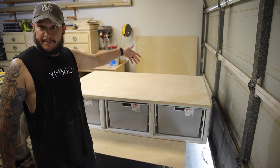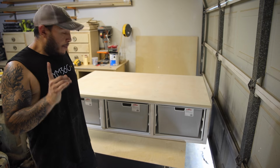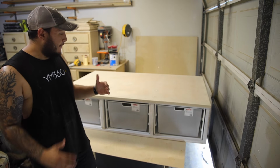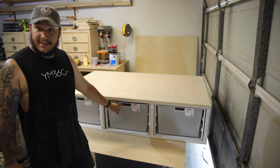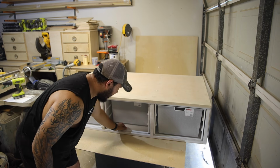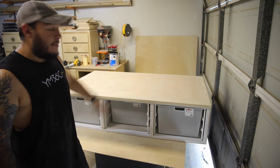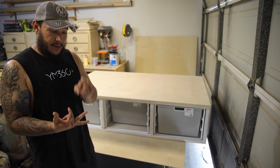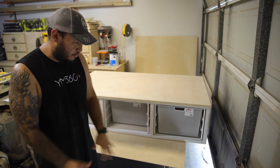The back also, I have it removable, and that's part of what the client wanted, to be able to access it. But I'm going to get 2x4s and create 3 frames basically. And those frames will go behind the baskets, and that will keep them from moving back. And then that also will give a structure in about the center of the pedestal, because I want to make sure that it's super sturdy, you know, with the dados, rabbets, the screws, the glue, and those structures, I think it is going to be plenty strong.